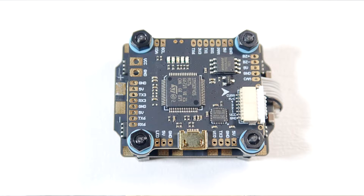Also the placement of some of the pads on the Mamba F405 flight controller itself is questionable — why would I want the VTX video output pad next to the USB? Not the best place to have it. Usually the best place for the camera input is on the front side and the VTX output on the other side, since the camera is in front and the VTX in the back. Still, adding two or three longer wires solves the problem.